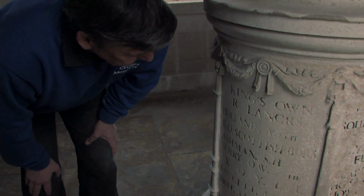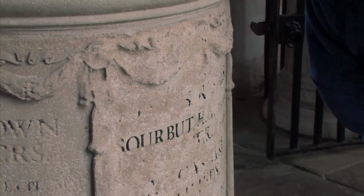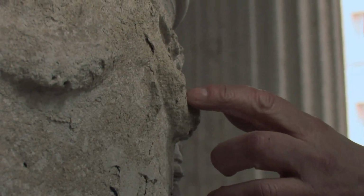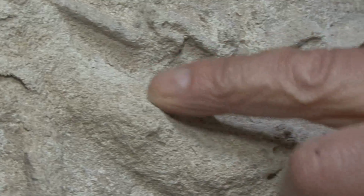Is it possible for the letters to be recut? Is the stone sufficiently robust to allow it to be worked back to a sound surface? It may be a poor quality piece of stone that cannot be recut. Friable stone is very difficult to treat. Consolidation treatments to preserve the stone can often cause further problems and are rarely a suitable solution.